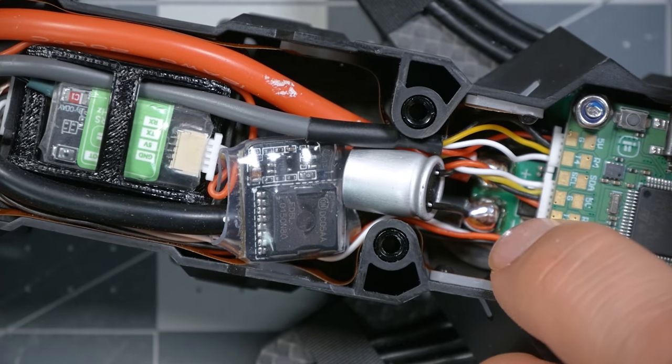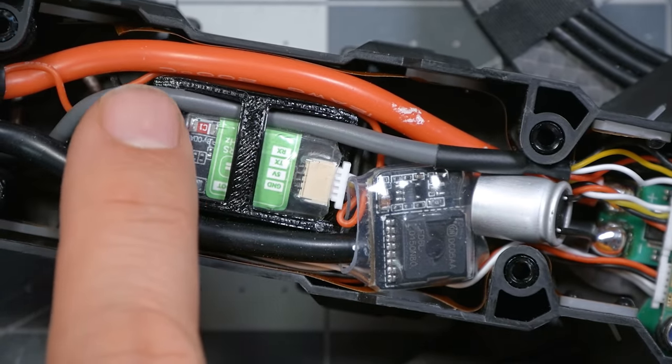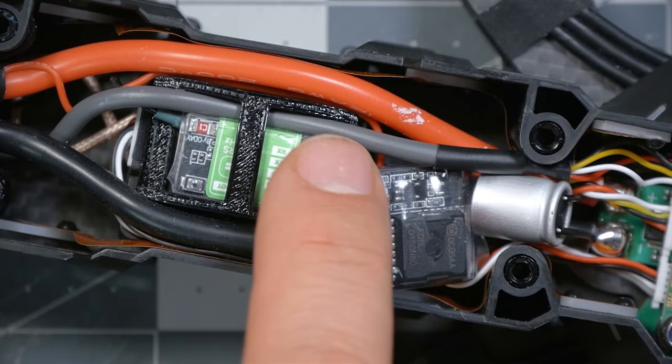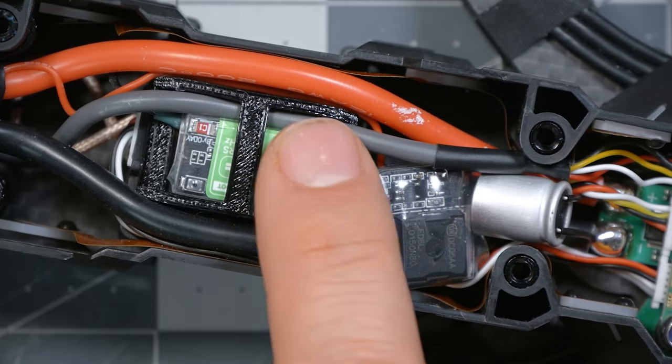We've just got perfect solder joints here. There's so much thought put into this, like the way this wire is run here to keep it from getting snagged or whatever. I believe this is the GPS wire, and it appears to have shielding on it. The GPS got locked very, very quickly. It took about 5 minutes to get locked the first time I was at a new location, and then after that it would lock within 30 seconds or a minute after power up, and it would easily get 8, 10, 12 satellites or even more.